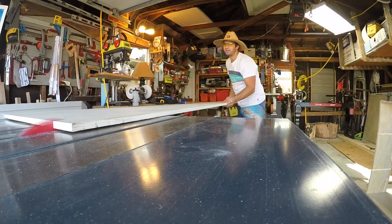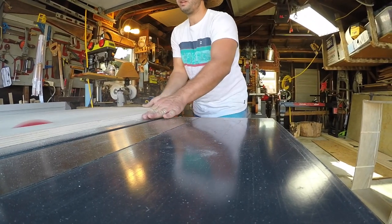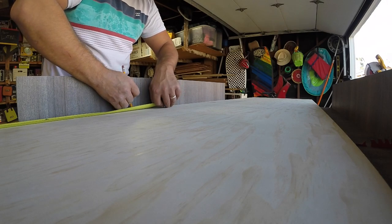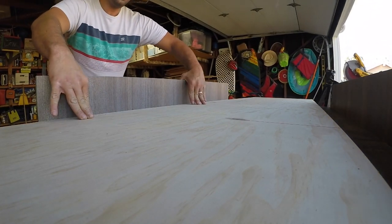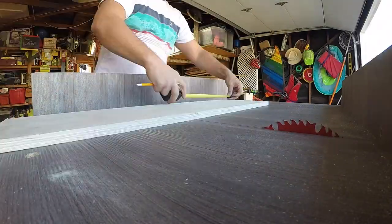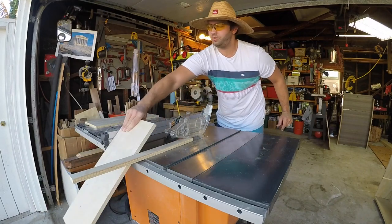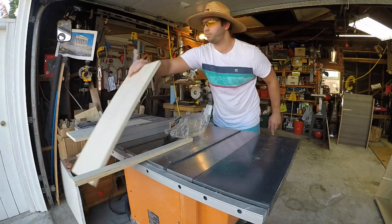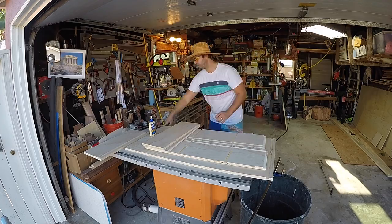Now that we've got our regular saw blade in, grab the rest of the plywood and rip it down to 24 inches — this is going to fit the groove that we cut — and then we're going to go ahead and crosscut it to length. The length of my panel is 35 and 13/16 inches. Having a crosscut sled in the shop that can rip down such a big width has been an invaluable asset. Here we're cutting the rest of the two shelves at 24 inches apiece and then ripping them down to length.